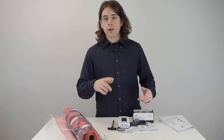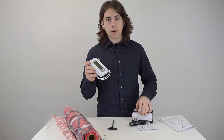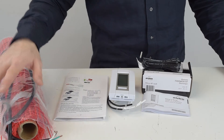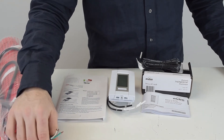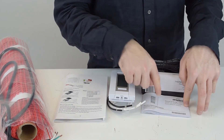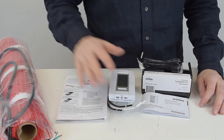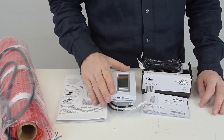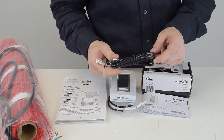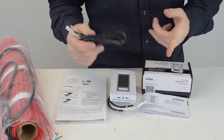You'll want to make sure you have a power line that goes to your area so you can connect your thermostat to your power leads and your sensor to your thermostat. Next, check the resistance with a multimeter and reference the thermostat installation guide for the reading information. Then follow the instructions in the manual to connect your heat mat to the thermostat. This also requires running the sensor between the heat zone, but make sure you don't place it over any of the heating cables so you get a good reading.